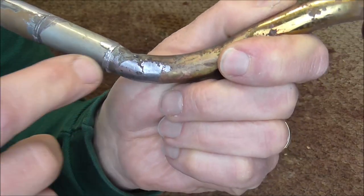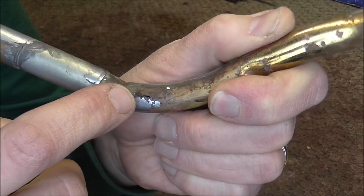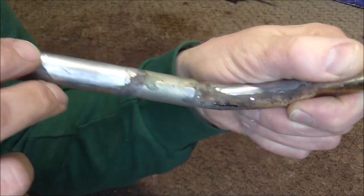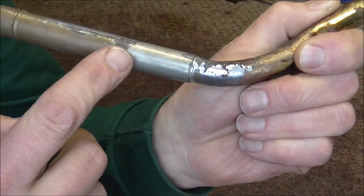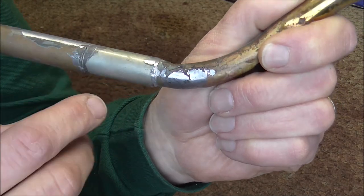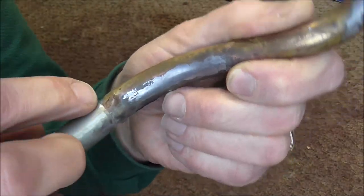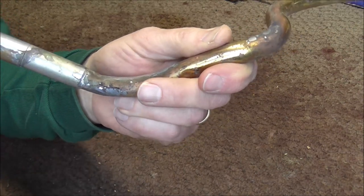Here's an example of some serious red rot. It does not look red because there's some solder on it and it tarnished a bit over the years. I'm guessing the metal underneath got very weak and then somebody bent this lead pipe, which caused it to crack. You can see that someone tried to cover it over the years — probably to cover other red rot issues — and then somebody also tried to patch something up. But the red rot was bad enough that this cracked, and there's also another small hole right there. So this lead pipe was in very bad shape and needed to be replaced.